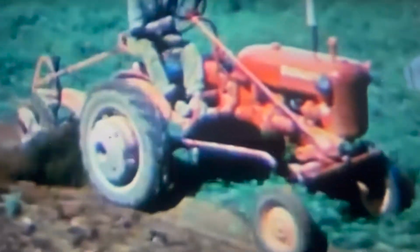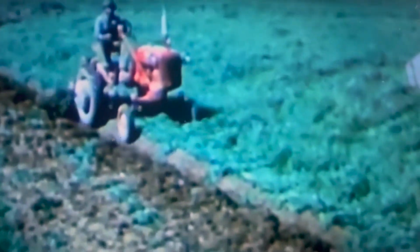In stubborn soil, the disc plow is especially effective. The 26-inch heat-treated disc cuts a 10-inch furrow. Rugged construction plus wheel weights ensure that the disc will be held to its work under the toughest soil conditions. A harrow plow with two 24-inch discs that take a 15-inch cut is designed for shallow work and to cover more acreage.